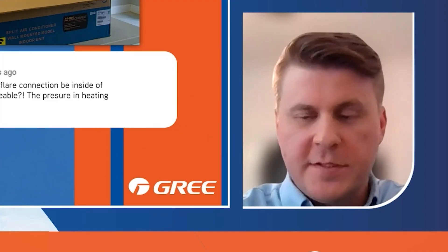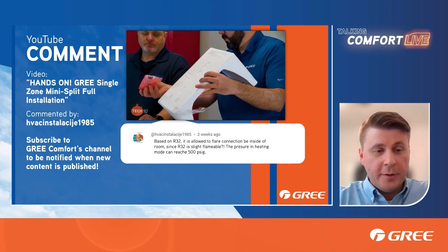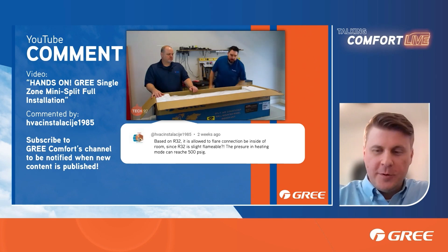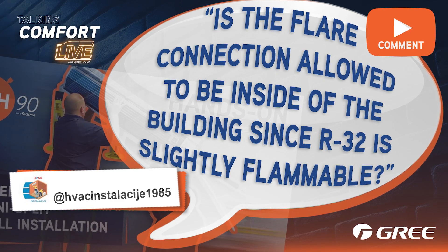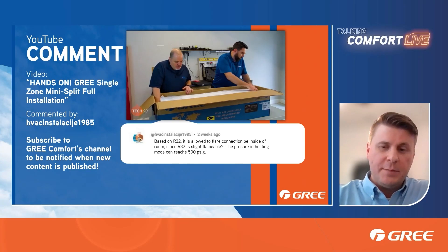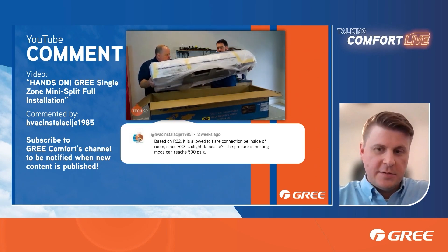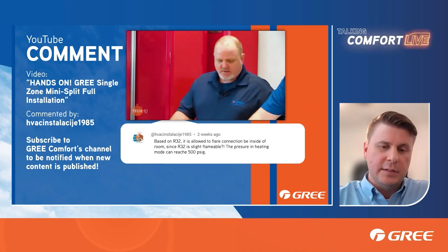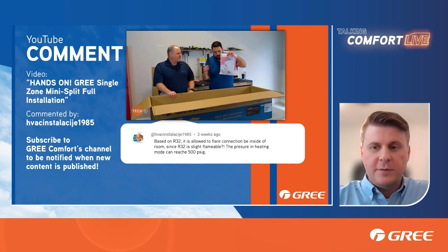There's not going to be any problem with it because pressure switches in the system are rated for over 600 psi, with burst pressures over 1,000 psi. As long as you're using good quality copper that doesn't have thinned-out walls and it follows standard burst pressure specs, you shouldn't have any worries. As long as you're forming your flares correctly and torquing the flare nuts down correctly per the specs, following all best practices, you won't have to worry about leaks. If something does happen, there are leak detection sensors on the indoor units — if it gets over 10% concentration it will sound the alarm and run the fan.